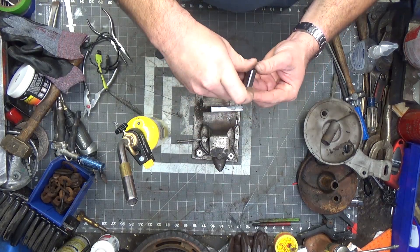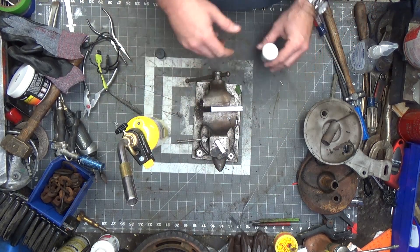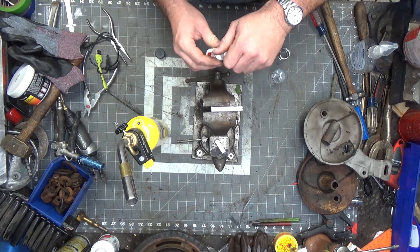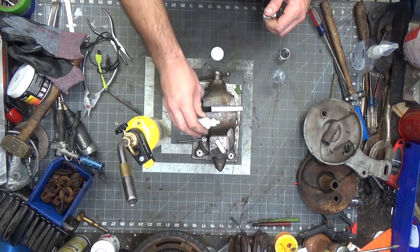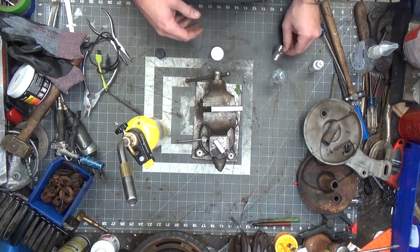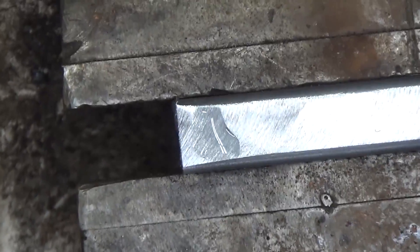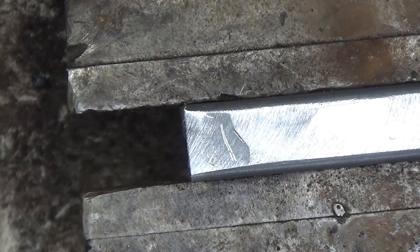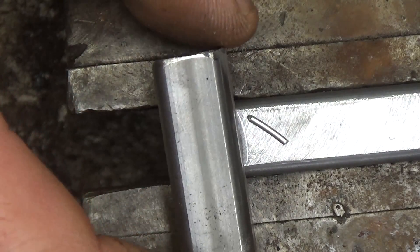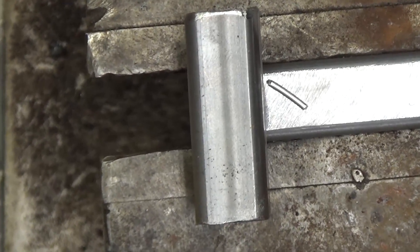I've got this cleaned up nicely — nice and shiny — there should be no contamination on it. I'm going to try my first shot at silver soldering two pieces of clean steel together. This is slightly larger than what I had done on a rifle recently. There are two parts: there's a flux — I'll put a little flux on both. The silver solder is interesting in that you're supposed to just put it next to what you want to solder. Ideally, this should chase the heat.